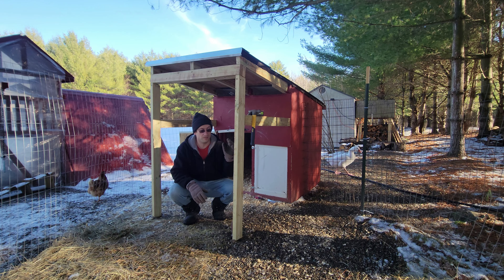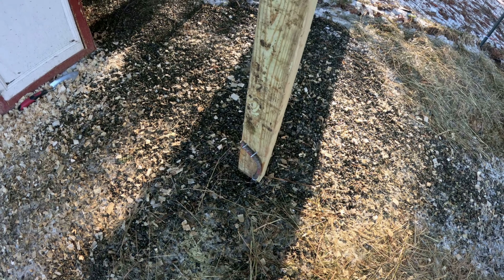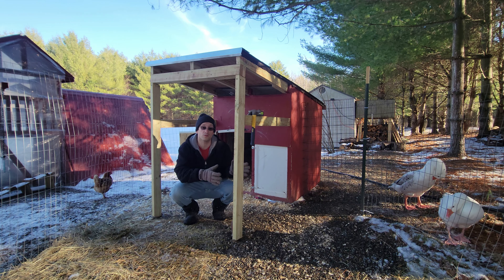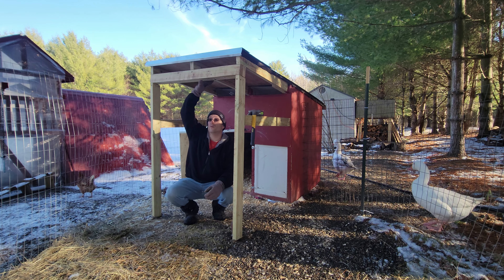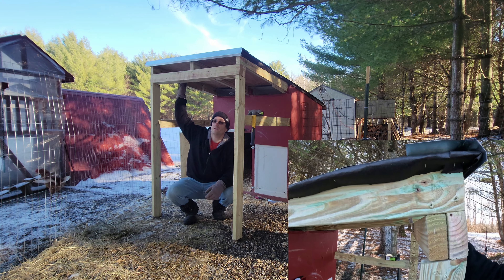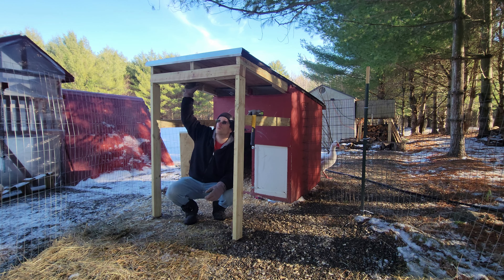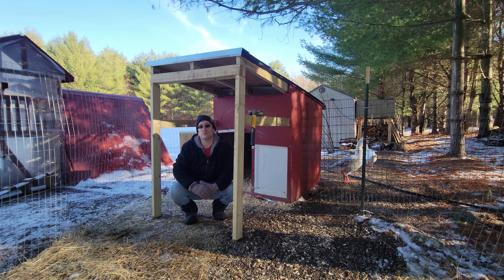All right, so we just finished it up. The legs are in, pounded into place with the rebar, so they're all good. Hopefully with some high winds if it catches up it won't go up, and the legs won't go in, out, left, right. It feels pretty sturdy. I did two 4x4s up here going across so that any weight coming down this center beam will get distributed to the two sides and it won't sag or potentially break and come straight down.